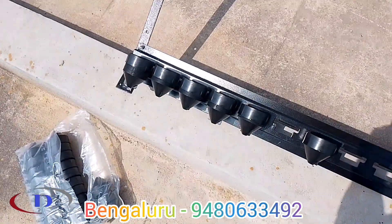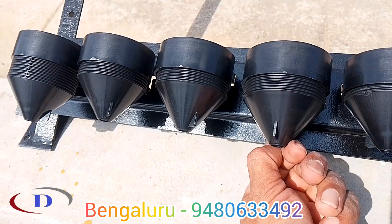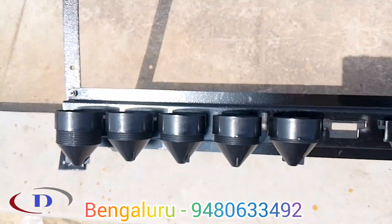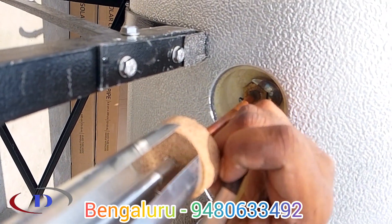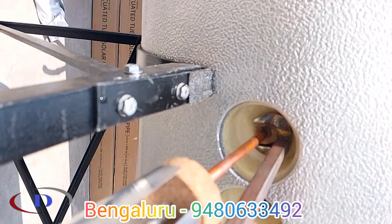In this model the inside tank is stainless steel SS 304L grade. These are the tube cups — tube holding cups, bottom cups. To fit these copper tubes to the tank we need a specially arranged spanner, and we have to make use of teflon tape on all these joints.